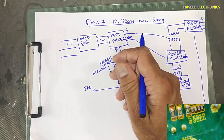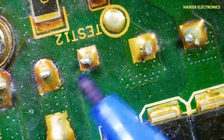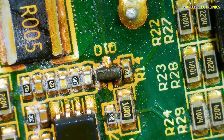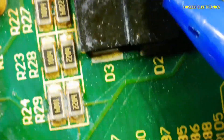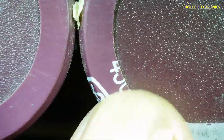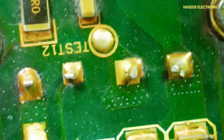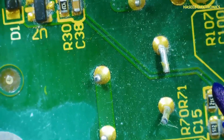The NCP1654 is a power factor controller IC that will drive its MOSFET or IGBT. The voltage is then rectified, and after that reaches these capacitors — two capacitors on the DC rail. In between this line there is a sub-protection area containing two components.